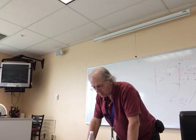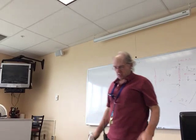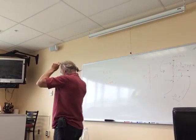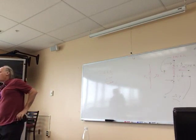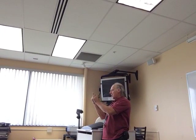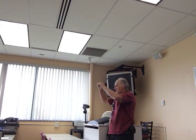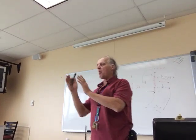So you have to take that into account. When you calculate the current in the circuit, you're going to see they have a 1K and a 10K, and a tenth of the current through the 10K. So it's going to split up. A tenth of that 1 milliamp is going to go through the 10K, and the rest of it is going to go through the 1K. The upper resistors are just voltage dividers, but nothing's happening with those. They look like a single limit resistor in series if you look at the total. So you have to be really careful. One will affect the other.